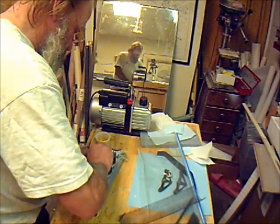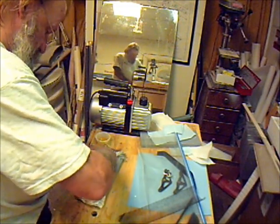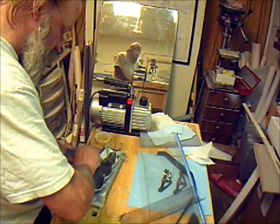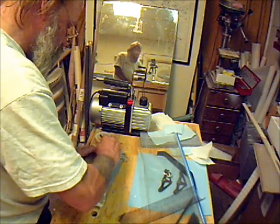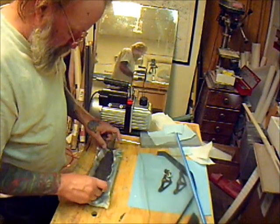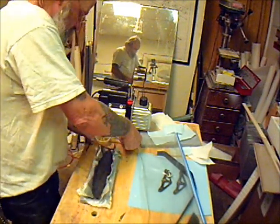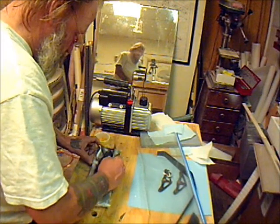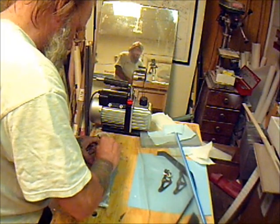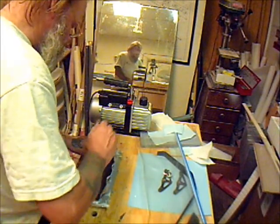Force that down in real good — make sure the glass gets good and saturated. You can tell by looking at it if the resin is forced through the fibers. Then I add another piece of carbon veil to kind of darken the finished product up. You could do one layer, but it looks better with two, and like I said I don't know whether the carbon veil is adding any strength — it just makes the wheel pant look better.